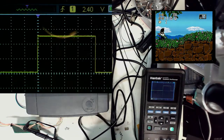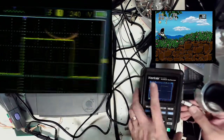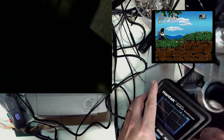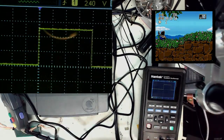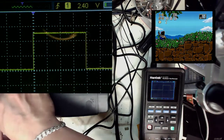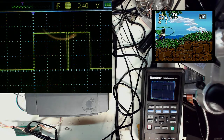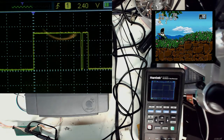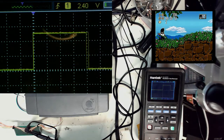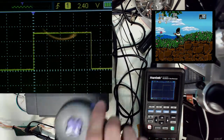Oh, come on, scope. Okay. Oh, I need to find the official USB-C adapter because otherwise it just falls out all the time. It just pisses me off. Okay, so wow, that's interesting. So you got up. This one's different. So that button's that. That one's that. That one's longer. It's further off to the right. See, that's virtually identical there, so it has to be latching another signal. So I gotta add another scope probe to this to really figure it out.